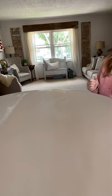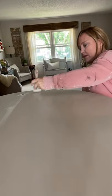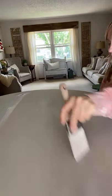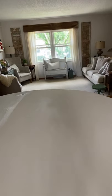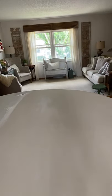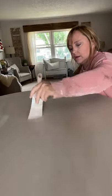Even over a color that looks very similar and should cover perfectly, I can already tell this will need another coat. Here I'm adding water where I can see brush strokes. Get a continuous spray bottle — they're really inexpensive on Amazon. The continuous ones give a finer mist, which is what you want. A regular spray bottle just squirts the water out and that's not really helpful.